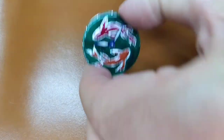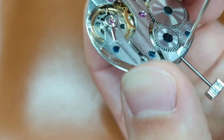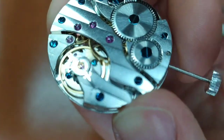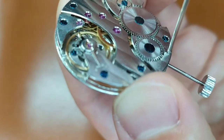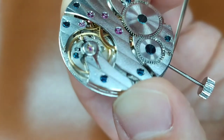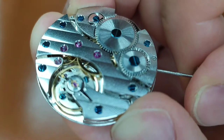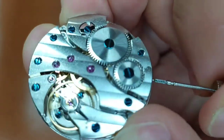In order to put the watch movement and the dial inside the watch case, we first have to remove the crown with its stem. For that, we have to unscrew just a bit the screw holding the stem inside the movement. Don't unscrew it more than you need — there might be huge problems if you unscrew it more than you should; you may even have to buy a new movement. First, unscrew it half a turn, which is 180 degrees, and try to pull the stem out. If it doesn't come out, continue with quarter turns of 90 degrees until the stem comes out.